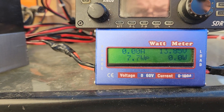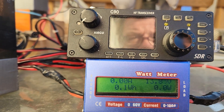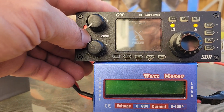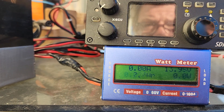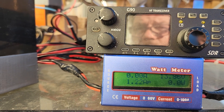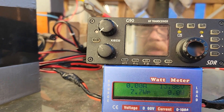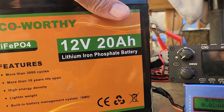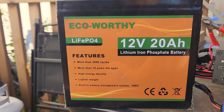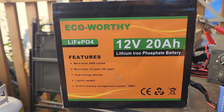As you can tell, it shows 13.8 volts, so you would think powering on the radio wouldn't be an issue — except it's not powering on the radio. When you go to demand power, you just lose voltage. I suspect perhaps an issue with the battery management system. The fact that it did this with two batteries that are less than one year old is a little concerning.